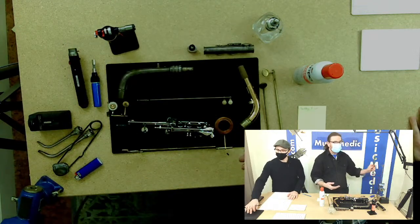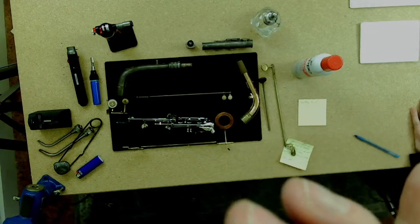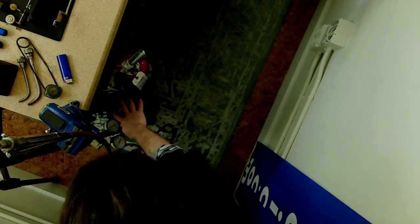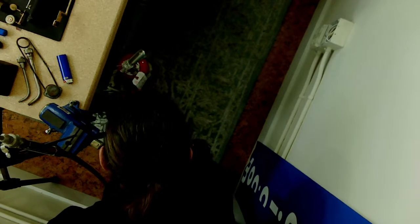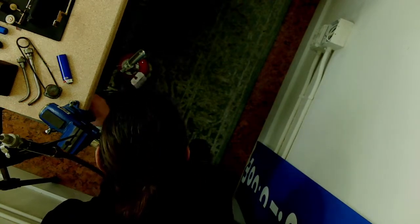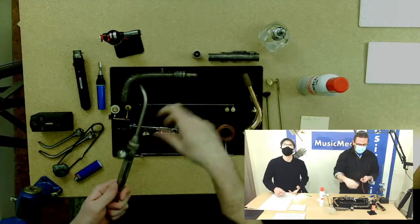For even bigger options, there's a torch like this with a hose attached that goes to a separate tank — this is an acetylene torch. The tank is right here next to the fire extinguisher. Here's the acetylene tank, here's the regulator, and the on/off valve. One important tip: when you have a big tank like this, make sure you secure it to something sturdy. You don't want it to wobble because if it falls and the regulator breaks off, you're going to have a really bad time. I've secured it to the leg of this bench — safety first.